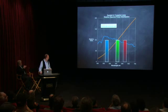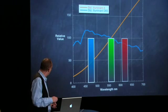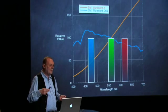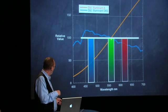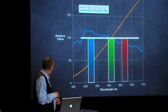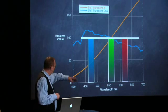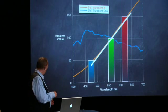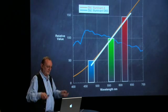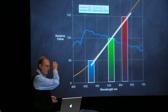What we'd really like is equal blue, green, and red. I've centered these at the peaks of where the color analysis normally goes. The way I like to think about color balancing the camera is like a beam balance — right now it's balanced. We don't change the green; we're going to pivot around the green. So the blue will go up and the red will go down. Basically, this is what happens if we shoot with a camera that's perfectly balanced to an arbitrary light source that has equal value in red, green, and blue.